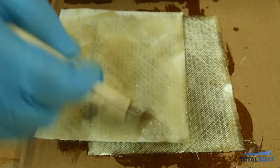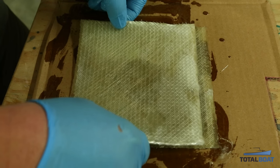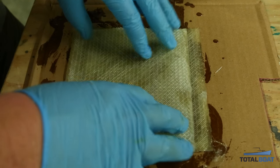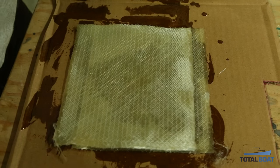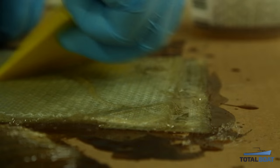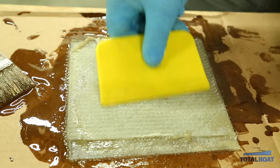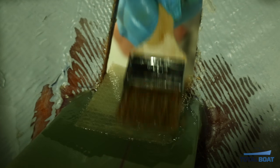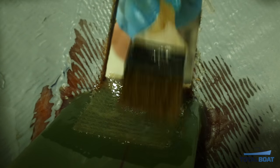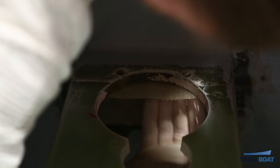Because the anchor locker is a little awkward and small, we wet out both layers of cloth on a scrap piece of cardboard before going up to the boat. After wetting out the first and second layers, we stagger the edges back so we don't get a big bump — this gives a tapered edge when we laminate. We use a squeegee to remove extra resin and air bubbles. The cloth is completely wetted out when it turns mostly clear. We then apply resin to the areas in the boat, put the cloth in place, dab on more resin with a paintbrush, work out any bubbles, and repeat the process for the aft end and underside of the shelf.